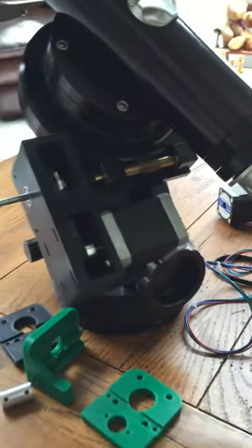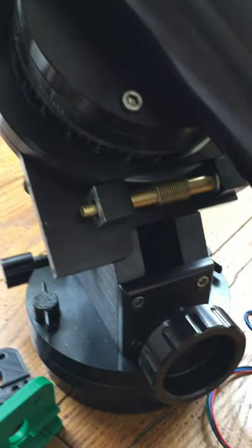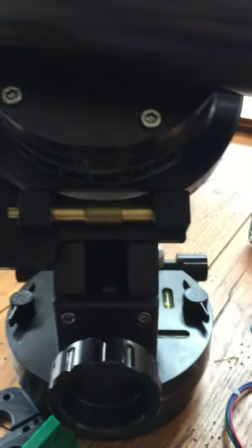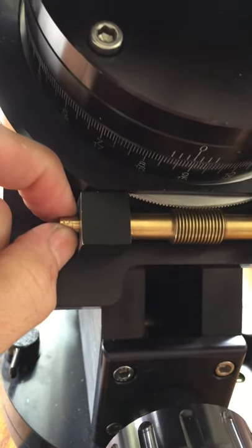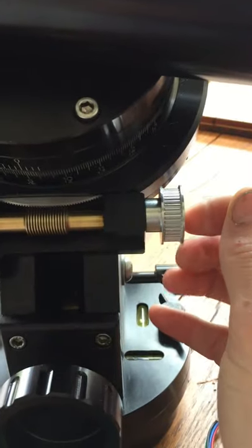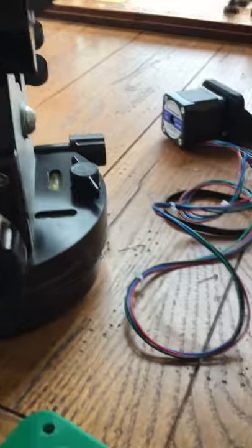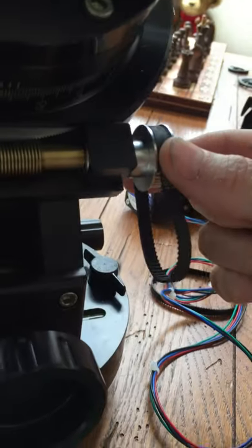That is certainly the way I'm going to run with it. With all that said, I think both of these options are kind of crappy to be honest. If I was to do this again — and I may well do this anyway — the third option is literally this bracket here, which you can swap around. Just take out two bolts and switch it around. I machined this face off to give a little more bite for mounting the coupling. But the point is if you flip this around, rather than the 60-tooth gear you can go with a 40-tooth gear. The 60 won't fit but a 40 fits just fine. You go with a GT2-180 belt instead of the 200.